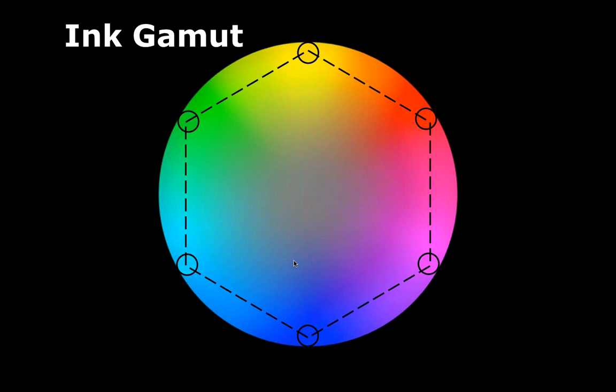And we have tools to make it very easy to work in a way where you can't achieve the whole gamut. You can communicate with the designer and the brand and the customer as to what colors you can achieve. You can have that discussion before you go to press. And we can work in a world with a far larger gamut than a 4-color gamut. Not as big as a spot color gamut mixed in an ink room, but we can get better looking packaging because we can apply it to images and gradients and blends and drop shadows and the like.